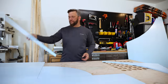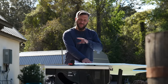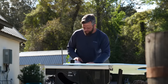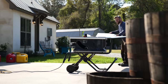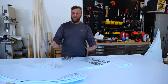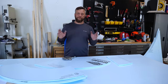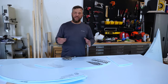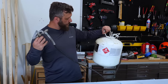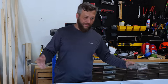There it is — the first base. I want these pavers to be two inches thick. The styrofoam itself is 5/8-inch thick, so I'm going to rip pieces for the sides at 2 and 5/8 inches wide — that will account for the base of the form being 5/8-inch thick. I'm going to flip all of these base pieces over so the concrete-contact side faces down and start applying adhesive. You can go to Home Depot or Lowe's and pick up contact cement and apply it with a brush — that'll probably work easier and less messy. What I'm going to use though is a tank of contact cement in spray form with a spray gun, because that's what I have.